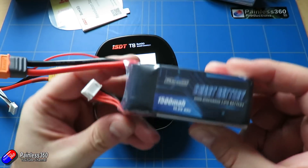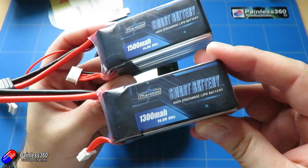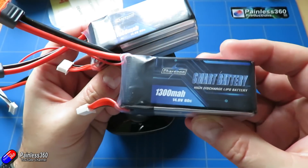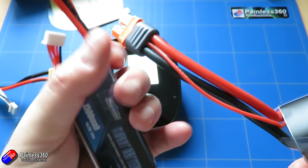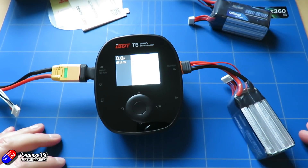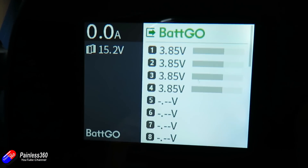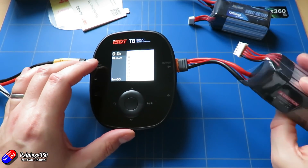The other things we have are a couple of smart batteries — I'll put links in the description so you can have a look. Both of these are 4S 14.8 volt units; the spec reckons both will charge at 5C. They look pretty normal with the exception of that extra wire going up to the XT60i connector. If I plug one of these in, all of the information about the cell voltages is actually displayed in the window even though the balance tap isn't connected.